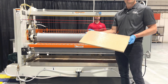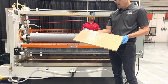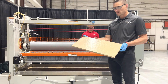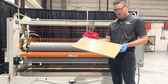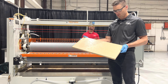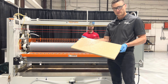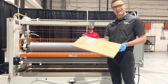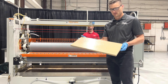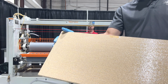Visually looking at this, I'm seeing a groove pattern that doesn't necessarily have full coverage of that panel yet — but that's okay. That groove pattern gives you the peaks and valleys of the adhesive. It's building adhesive in the high areas, and the low areas are going to get filled in when it goes into the laminating portion — whether into a cold press, a hot press, or even a nip press. That groove pattern is designed to squish down those peaks and valleys to give you uniform coverage. So you do want to see this groove pattern while you're applying panels.